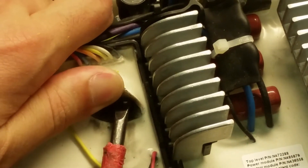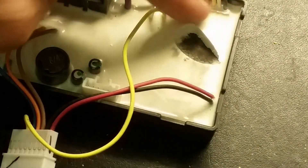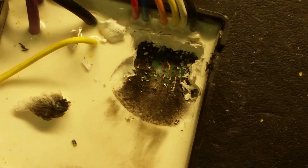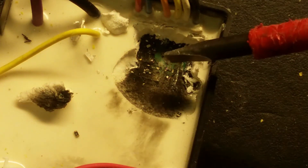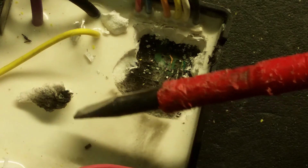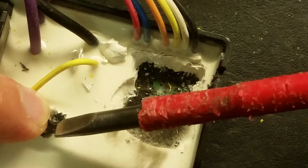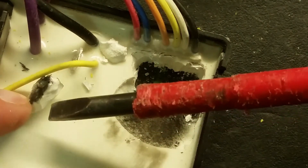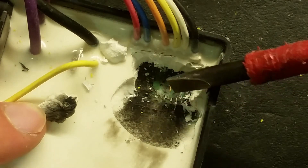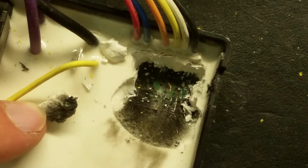There's a lot of darkness in here. I removed some of that resin and look at that - it's very blackened. Maybe I can cut around this to have a look at the circuit board and see what component blew. I managed to remove some of that resin and I found some components. This is a little resistor here - that's not blown. But I think there's a molten SMD transistor on this piece of resin. I really can't get it off. You can see the pads here, these three connections, so I think that one blew and the whole thing exploded.